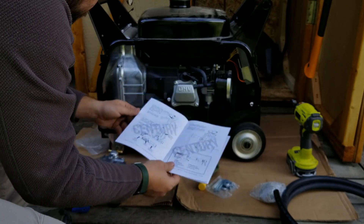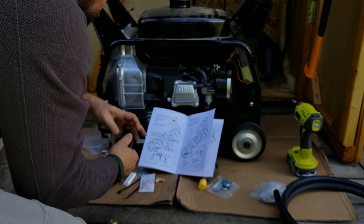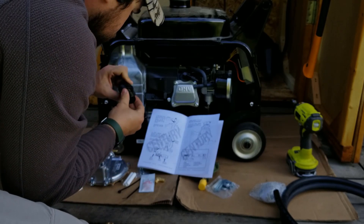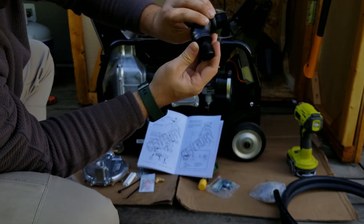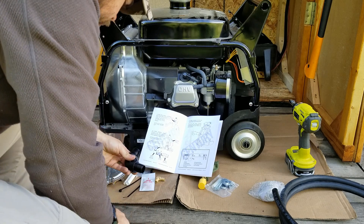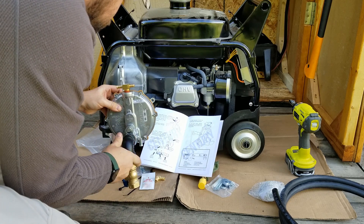Here's a ball valve. According to the diagram we've got the thread, the angle piece, another angle piece connected to the elbow, and another threaded piece which has a big chunk kind of welded into it. You can see there's a big chunk of metal stuck right there on the threads. So I've got that fitting and ball valve assembled loosely first — this is supposed to go on the front here. Then place the regulator on the generator removable panel — you may mount the regulator anywhere within 19 inches of the adapter, but it's recommended to mount it as close as possible.